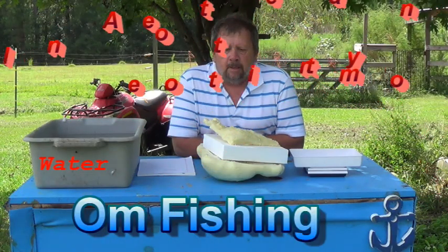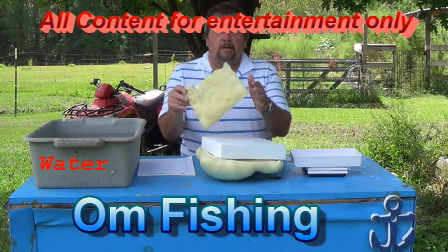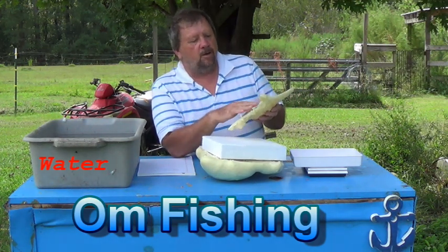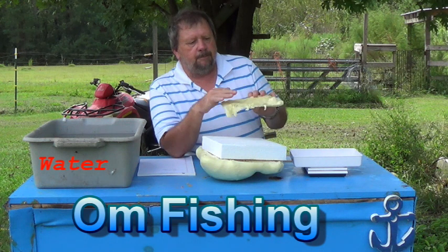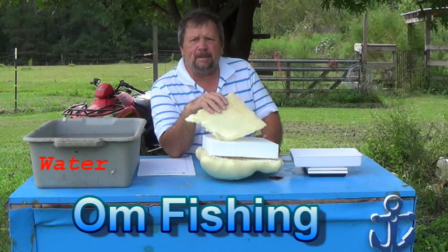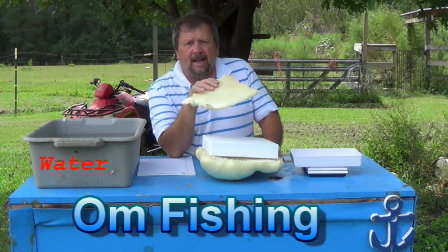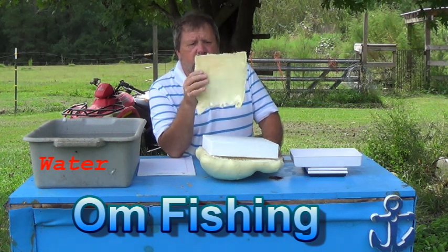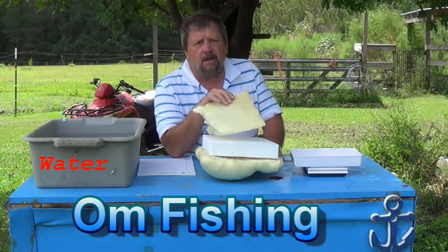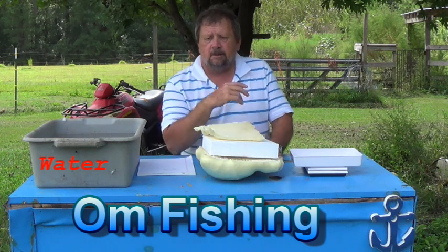What we're going to do today is I'm going to take some of this buoyancy foam here. This is actually where it came up and it was too tall and I cut it off. So if the cells were sealed, because of the top they're open now. What I'm going to do is weigh each piece, then put it in the water and bring it back out to see if it picks up any weight from the pores, then resubmerge it and come back in about a week and weigh it again.